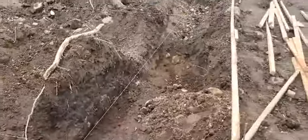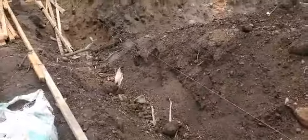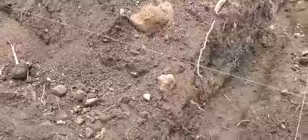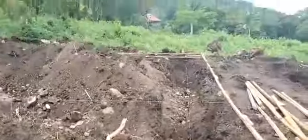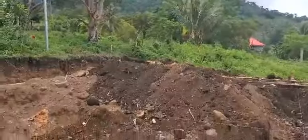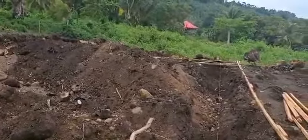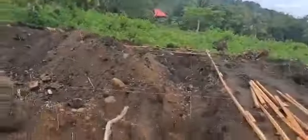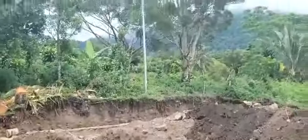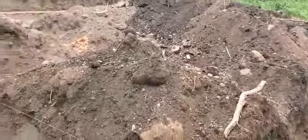There are going to be 25 cement columns, and then there'll be tie beams going across. There'll be a beam under grade — underground — with rebar and cement, and when the columns go up there'll also be a tie beam across the top. So really the cinder block walls have no structural significance at all — it's just a wall. The columns go a meter down, straight up, with a tie beam across the bottom and a beam across the top — that's what shoulders all the weight.